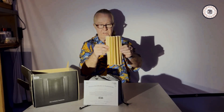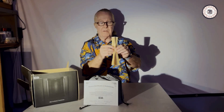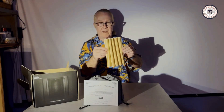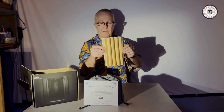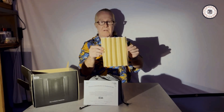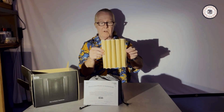Why did he do that? Because when the accordion goes in, the membrane squeezes the air out. In and out — not like a dome, ribbon, or electrostatic speaker. This reproduces air velocity five times what you could get out of a dome, a ribbon, or an electrostat.